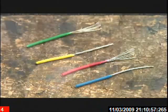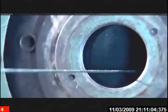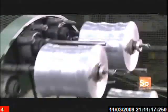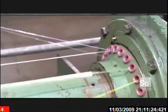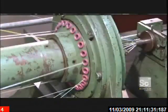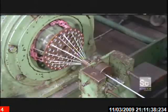The conductor then enters a machine called a cabler. It unrolls spools of insulated conductors and unites them with other components to form the cable's inner workings. At the center of this particular cable is a twisted pair of insulated conductors. Around them go color-coded insulated conductors and fillers — strands of polypropylene foam — to fill in the gaps between the conductors, giving the cable a smooth, cylindrical shape. An orientation plate aligns the components in the proper configuration as they enter the cable assembly die, and the components exit with the fillers wound around the insulated conductors, which wrap around the central wire.